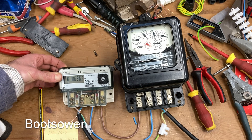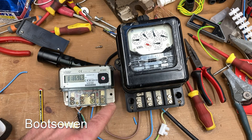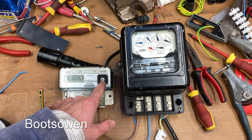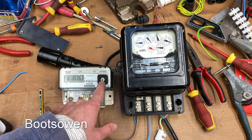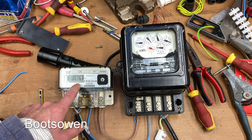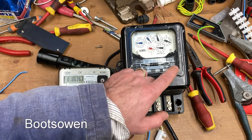You can just about see the flashing — it's quite dim. What I'd like to do now is reverse the direction on both at the same time. I think what will happen is the analog may or may not run backwards, and this digital one, instead of showing a flashing pulse for electricity used, should display a solid red. This meter is configurable — you can set it as an import-export meter — but with just a plain white sticker I think it only records kilowatt hours. This is an LG type CH1, marked CH1 E-L-G-E-E, and it was the property of the Northwestern Electricity Board — it presumably came out of a skip.